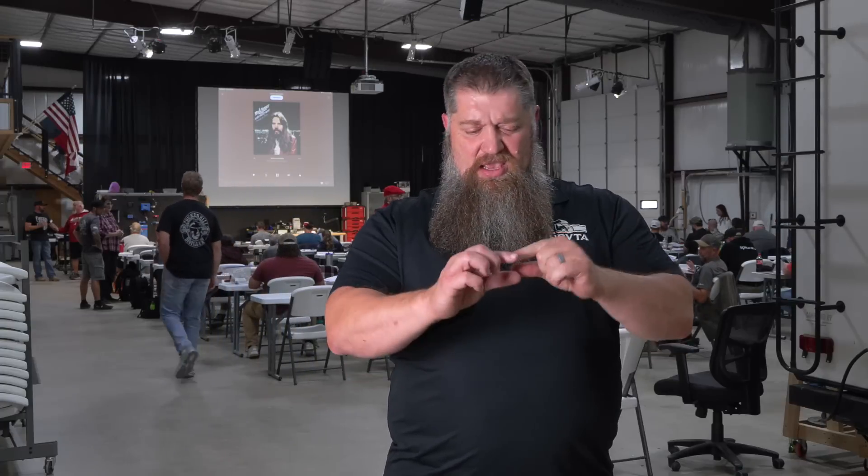If you've got zero volts AC, then you're free and clear to break out your number two square head and tighten up, mainly on the neutral side. You have a neutral bus bar — you want to tighten that stuff up. If you keep that tight, chances are you're going to have fewer potential problems with loose connections.